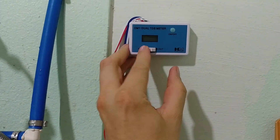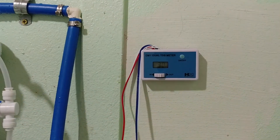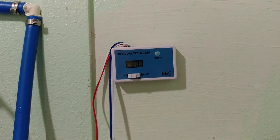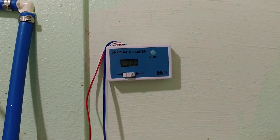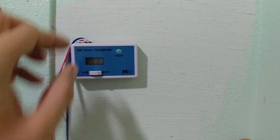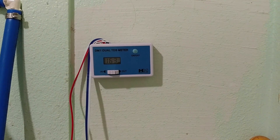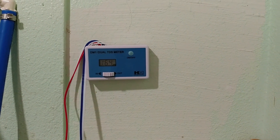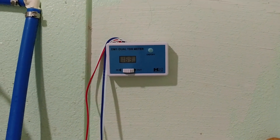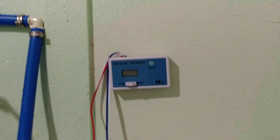The sensors let me know how my water quality is at a given point, how well the system is working, and whether my membranes are going bad. You've got two options — in and out — so it's an easy way to compare your tap water to your RO water. You can see the reverse osmosis water is totaling about 30 parts per million total dissolved solids. The out, which is a mixture of tap and RO, hovers between 150 and 170 — it usually stays right at 160.